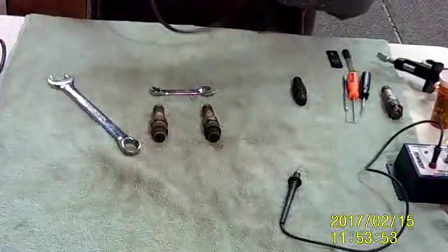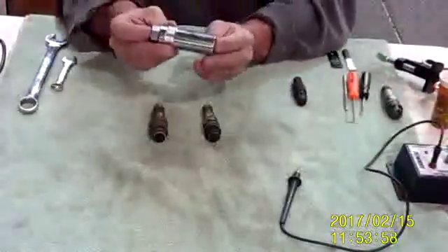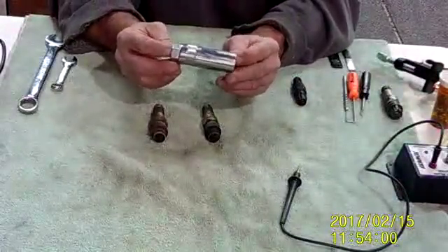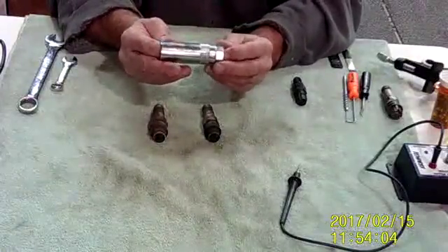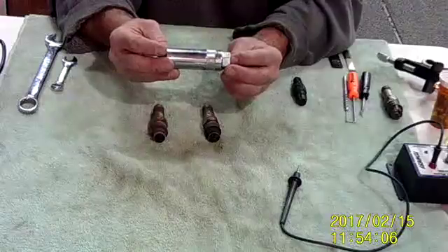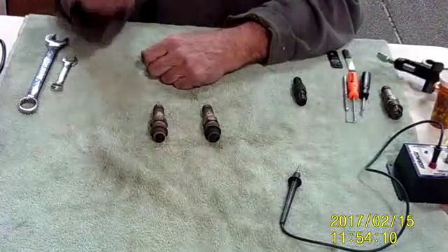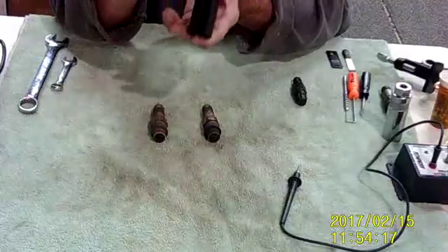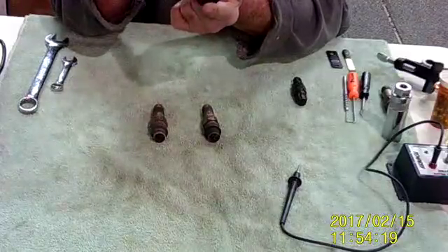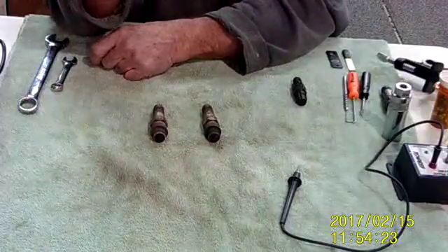The other tool you'll need is a spark plug tool, and these are available from Aircraft Tool Supply. But Grumman owners being frugal, there's a lot of other options you can use. This is a spark plug tool from Aircraft Tool Supply. You can also go to Harbor Freight for $2.95 and get a 7/8-inch oxygen sensor socket — it does the same thing.